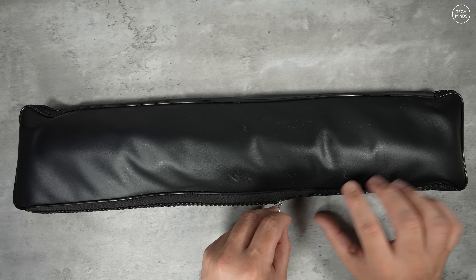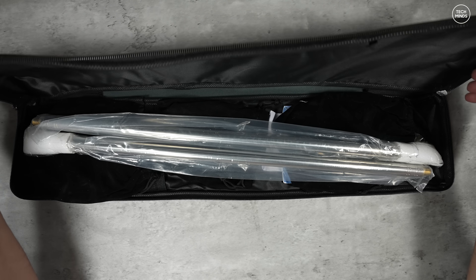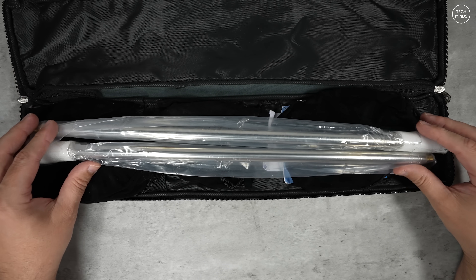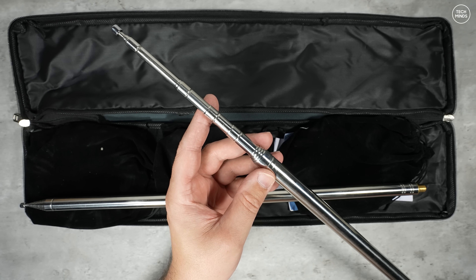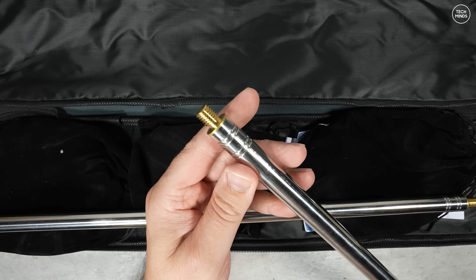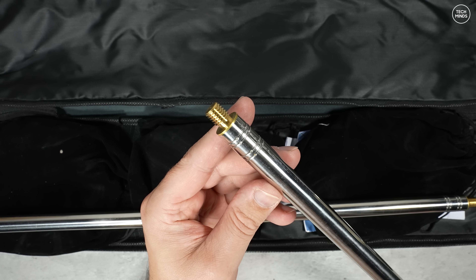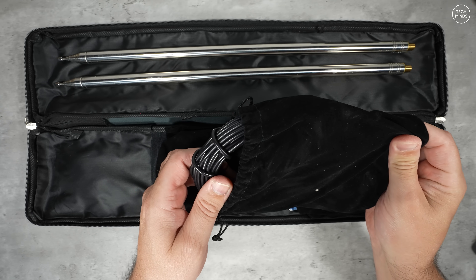This antenna is specced to cover from 7 MHz to 430 MHz with a power handling of up to 400 watts. The antenna itself is made from two elements which are telescopic to allow for tuning to the desired band, and when mounted they're in a V-shape at a 90 degree angle — so that's essentially a V-dipole.